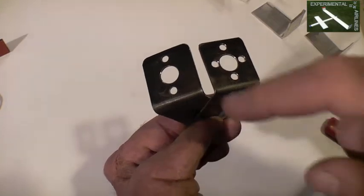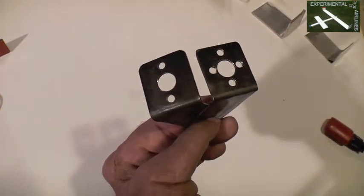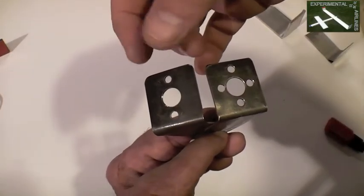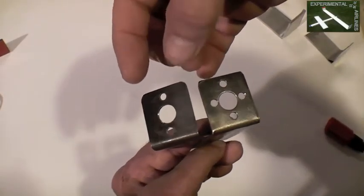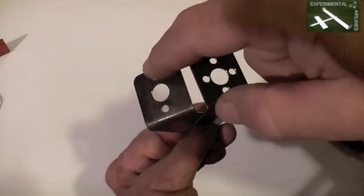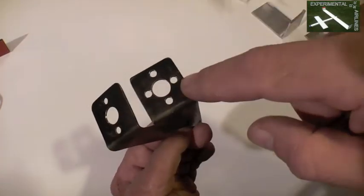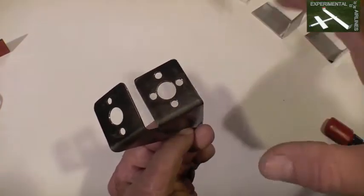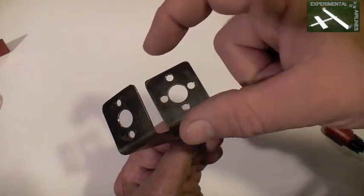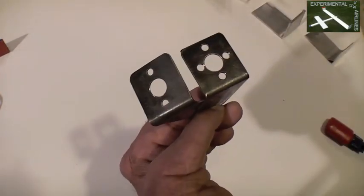While it's tempting to get by with two screw holes, and you probably will get away with it for a while, eventually that motor — which unless it's perfectly balanced is going to vibrate back and forth perhaps ten thousand times a minute — is going to apply a lot of torque against those two screws and gradually come loose. It's really better practice to take the extra time and make all four screw holes so that it's stable in each axis versus vibration and flight stresses.